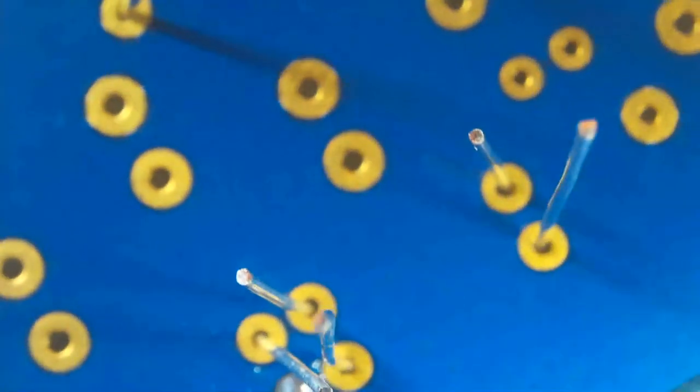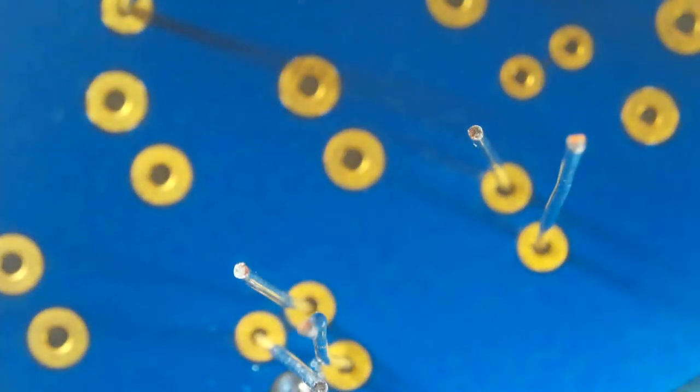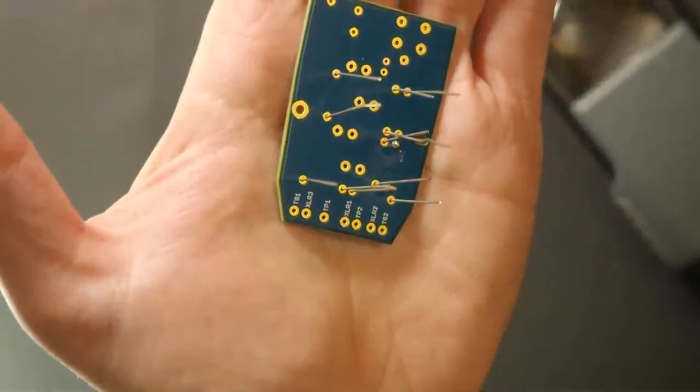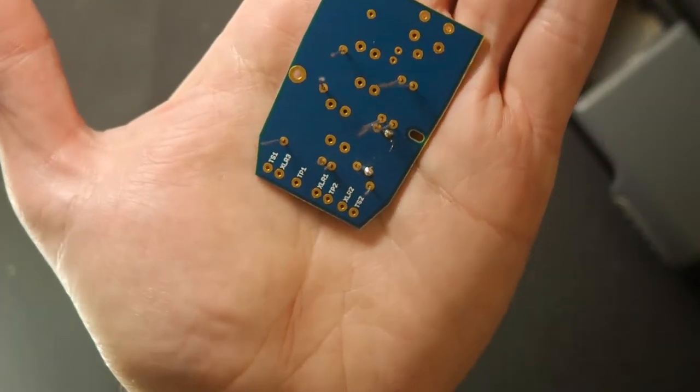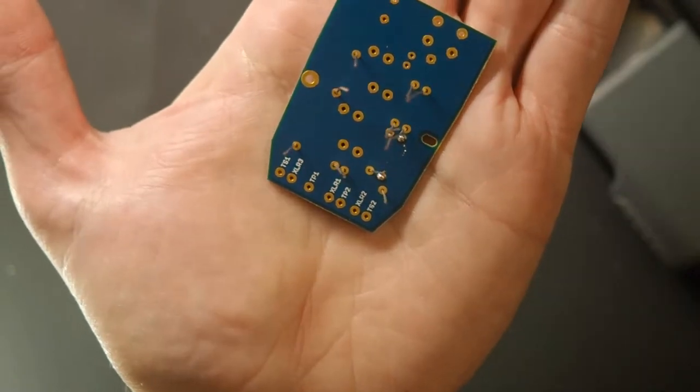So we just need to sort of drop this in here, switch back to this, throw some lights on. Okay, now when we're soldering, there's a lot of stuff here, and I can't zoom out more. What I can do is show it more from here. So there's a lot of stuff here, so you just kind of solder from the outside in. And if necessary, we can clip some leads off to give us access to the ones on the inside of the board.